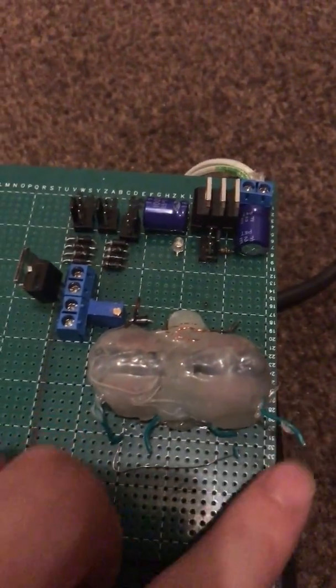These are some diodes — 1N4007s, I believe. When I'm not using the six volts, this will drop down the voltage further using the natural voltage drop of diodes, which is about 0.6 to 0.7 volts each, so I'm going to lose about 1.4 volts. Since I'm using quite a bit of current, I've put them in series as well as parallel to get four amps with that 1.4-volt drop.